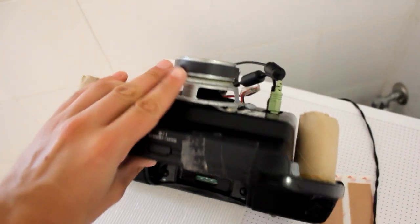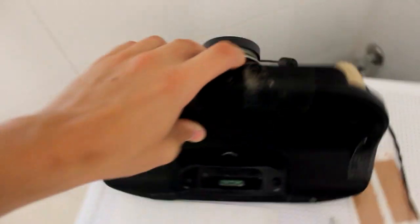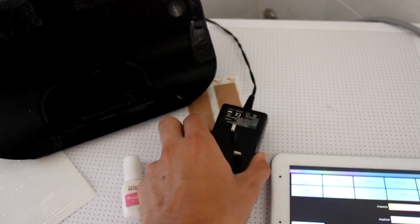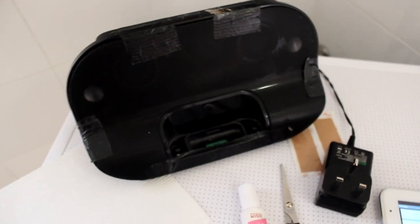The subwoofer — I've replaced the speaker. This was a much better speaker from a Philips system. It fitted nicely, invert mounted, which obviously created more space inside the enclosure. It's actually a little ported enclosure — you can see that port there. It tunes it to about 50 Hz currently. The original power adapter was 9 volts and at maximum volume it was distorting as if there wasn't enough power. So I'm using a 12V power supply, giving it more voltage than it's designed for. It seems to be working fine for now, and if it blows up, I'm not too fussed because it was completely free.